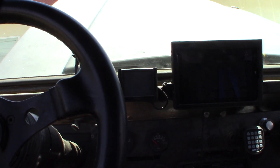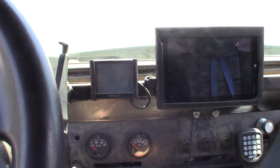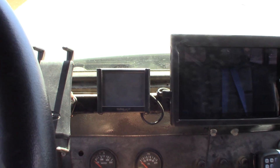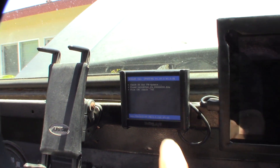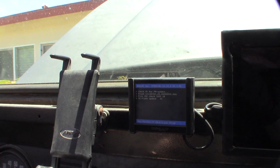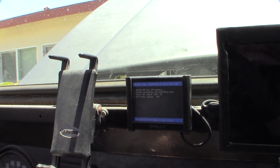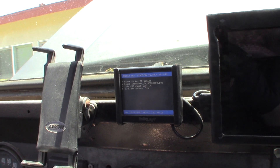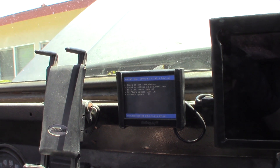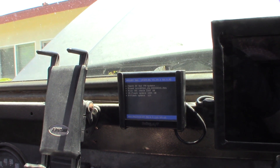I can't remember if I need to turn this on first, because I have that new firmware file in the root directory and it might upgrade the touch screen automatically. See right there — 'file check.' If it finds a new firmware file in the root directory of the SD card, that's how you update the touch screen — it will automatically find the newest version. It's upgrading the touch screen to version 5 right now.